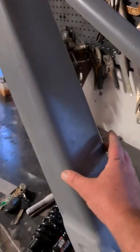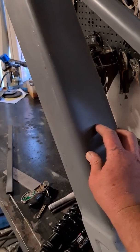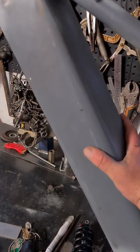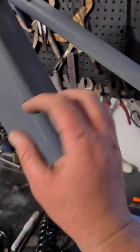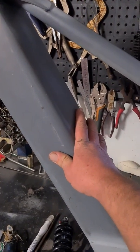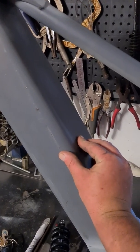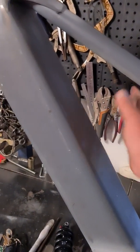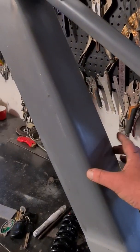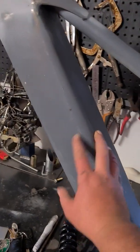I folded this by hand with a pan brake I made out of some bits of angle. When I designed it in CAD it had a k-factor and bend allowance for a hydraulic press brake, which would have made a tighter radius and not stretched as far. This actually stretched quite a long way and ended up wider in both directions than designed — I'm kind of happy it did because it gives me more clearance for the battery. It's almost 100mm in both directions, slightly more or slightly less.